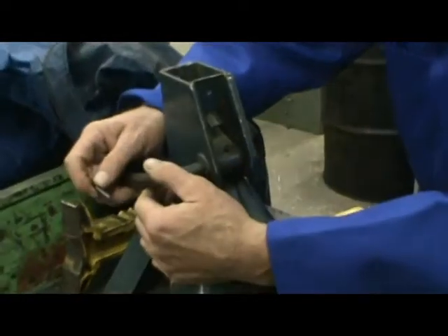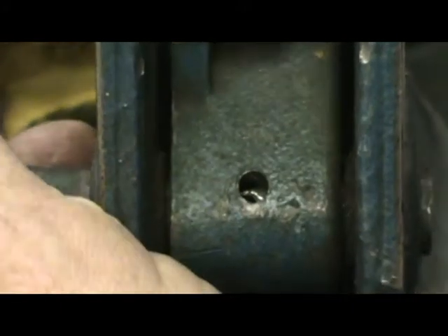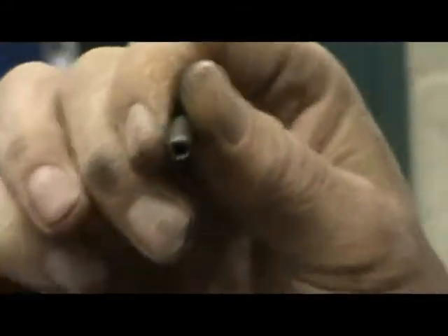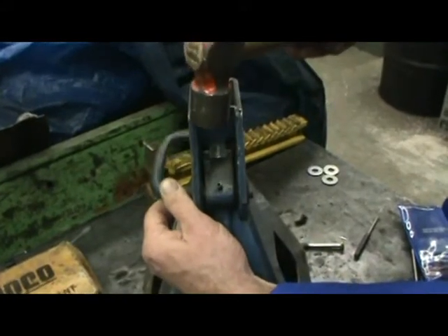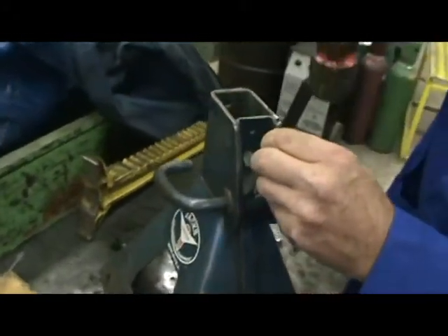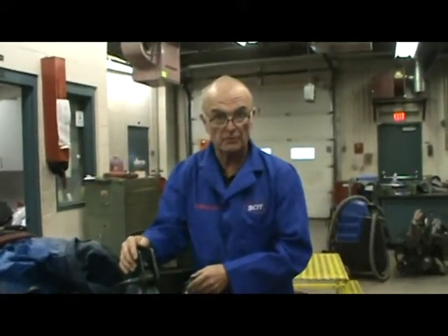I've removed the roll pin and you can see the two holes — if you look in there you can see the two holes. You've got to line them up. You can see this roll pin is a little flattened on one end — if there's any problem at all you'd just take the grinder and bevel it. To install it, you don't need the pin punch initially — just line the holes up and gently tap so you know you're aligned. Then use the larger punch to install it correctly. The handle was on the wrong way at the beginning — that was an improper installation, and we've just repaired that.